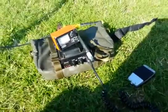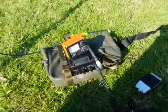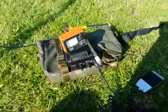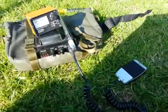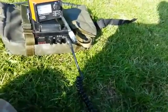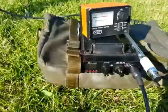As you can see, we've got Charlie Tango 171 from Spain, 3-0 division, coming through on channel 23. SWR indicated the antenna needs shortening a bit, so I've folded the top over and brought it down, and the SWR is actually fine now. 163 division trying — Charlie Tango 009, 163 division trying.